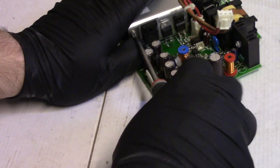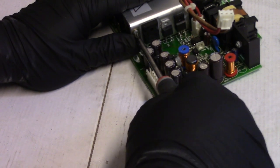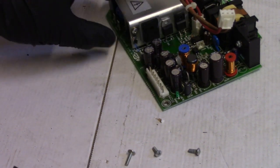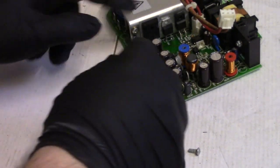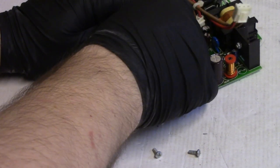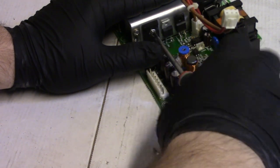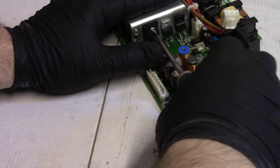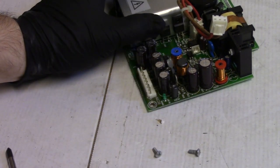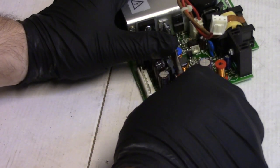And this thermistor, I suppose, is to measure if this heat sink ever gets too hot, so it can shut itself down before the big guy goes bad. They use these IRFP460s in xenon power supplies that I work on. So it's a heavy duty MOSFET. It's big, lots of power. Lots and lots of power.